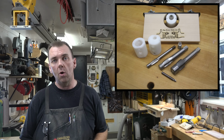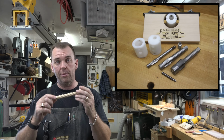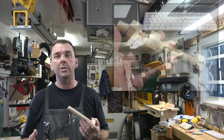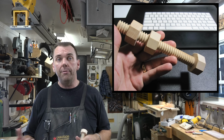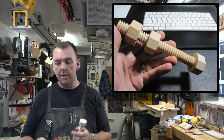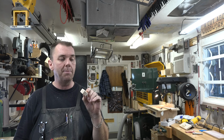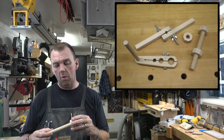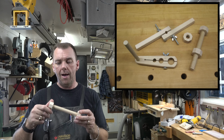I mean, you saw on the show, it took me 4 tries to get it adjusted to make the thread successfully. I'm not concerned about that. Every new tool, especially a jig, even one that you made in your own shop, takes quite a bit of mucking around and finagling in order to get it set properly to get the results that you want. As I said in the last segment, thicker nuts are the way to go in this case, if that's what you want for the threads for a wooden nut and bolt application.